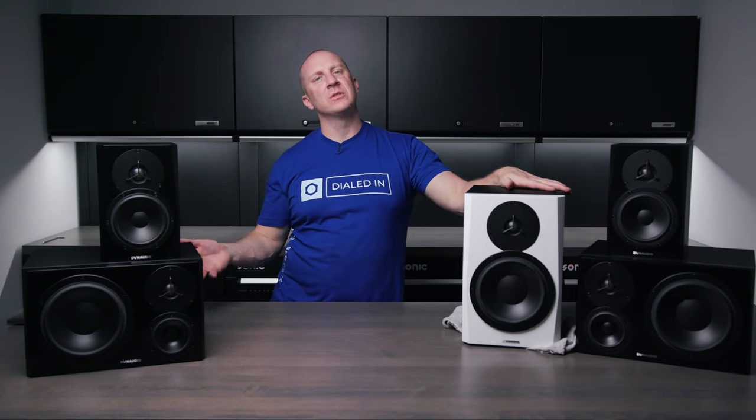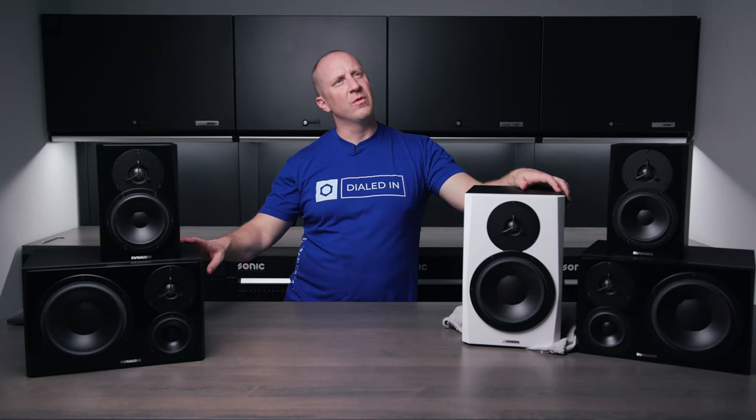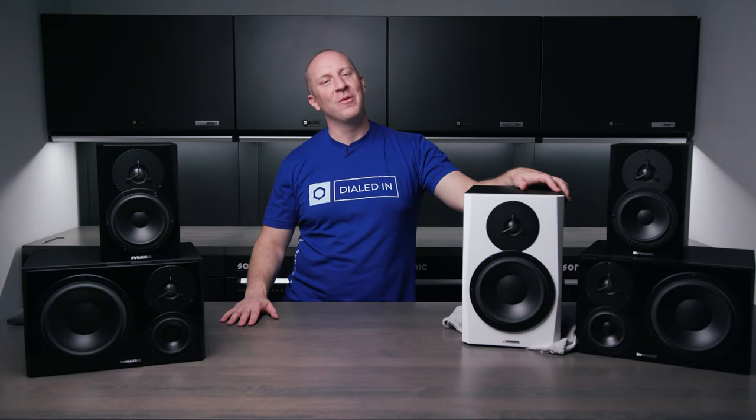So the woofer can play lower frequencies, and the mid-bass can pick up that frequency range of, say, 2 kilohertz up to wherever it's going to cross over for the tweeter. The mid-bass driver does take some of the weight off of the woofer. I'm not sure where they cross over, it's in the specifications. I may be wrong, it may be crossing over at 2K up to the tweeter, and the woofer crossing over somewhere in the hundreds. It really doesn't matter, so I wouldn't get too excited about specs and amplifier outputs and stuff like that. It's really about the complete package and what it sounds like.